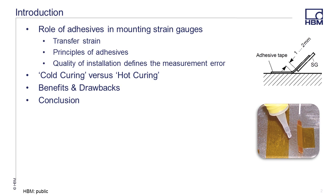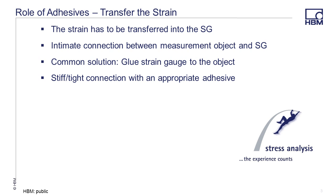There are two basic types of adhesives: cold or hot curing. We will discuss the benefits and drawbacks of each adhesive type we offer. Since the strain gauge is a sensor, you need to transfer the strain on the test piece into the strain gauge in order to properly present what is exactly happening at the test piece. So there needs to be a very intimate connection between the gauge and the test article. The strain gauge is glued to the surface of the object, and ideally with a very tight connection, with an appropriate adhesive.